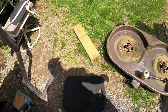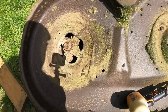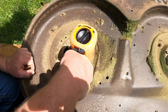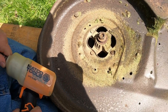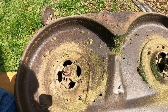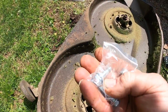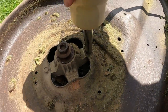I don't know if I need to take those guards off, but they have no nuts underneath so if we need to take them off we can do it from up top. Let me get a 13mm and start busting these spindles loose. We're going to bust them — not good. See, that's the problem: a 12-point socket is not taking these things apart. We're going to have to find a 6-point socket. We found a 6-point socket, put it on this one, and it snapped off the heads. That's one of the reasons I bought spindles that came with brand new bolts — I figured these bolts would break.